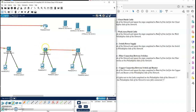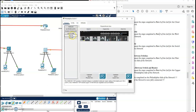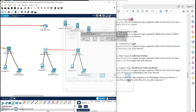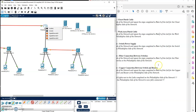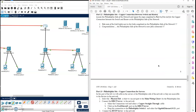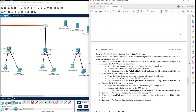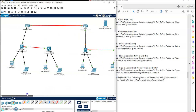Now we need the copper link between this switch and the router. I'll click on this switch and grab the twisted pair copper module and drag it into the far right slot — that way it'll be port four. Now I'm going to grab a copper straight through, click on this switch and go down to gigabit four, port 114. I'm going to make sure I'm using gigabit zero zero, because I'm using the same router as I had over there — gigabit zero zero.